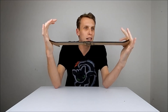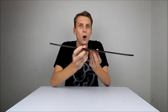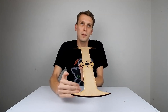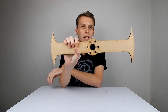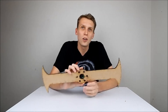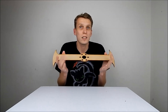By now those pieces should be dry, so let's go ahead and glue some more pieces on. This is going to be an overhead weapon, so it is going to be angled slightly, and then the wheels are going to be out the back, and there is going to be a 6mm hard-ox wedge underneath everything. The blade should contact opponents way before they contact the wedge. The wedge is there so that if and when this blade stops moving, I've still got some kind of defense - because this is going to be my first ever 13kg spinner, I wanted to make sure that even if the spinner died, the robot wasn't going to be completely defenseless.